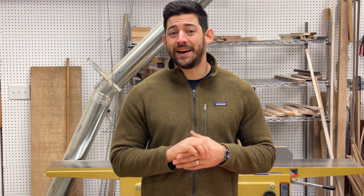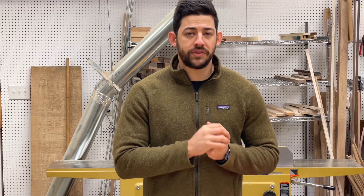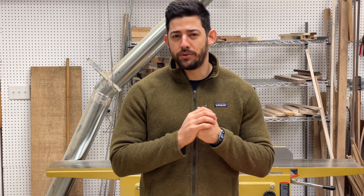With regards to kerf and miter saws, I highly recommend sticking with a thin kerf. Almost all miter saws do not have the power to run a full kerf — they're designed around thin kerf. Using a full kerf blade in a miter saw is going to result in a lot of bogging down on your motor and probably too much wear and tear on the machine.